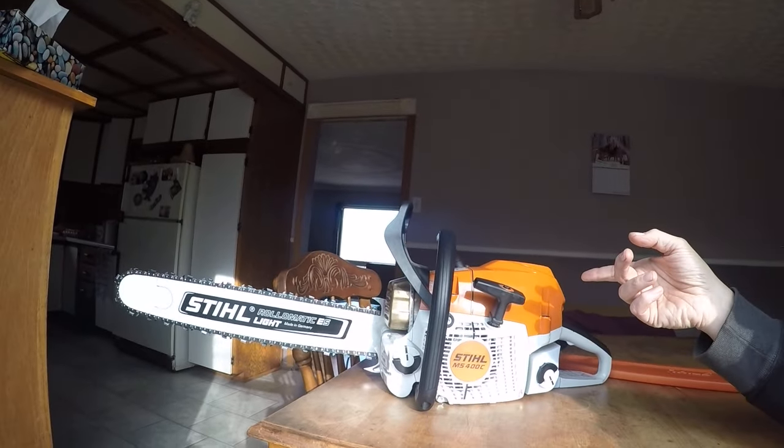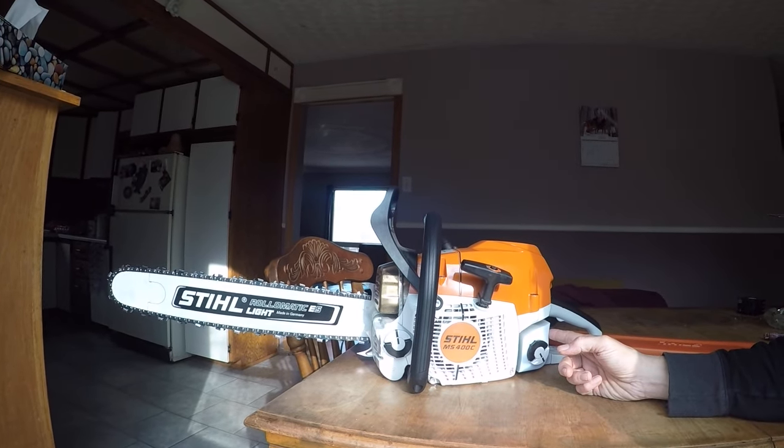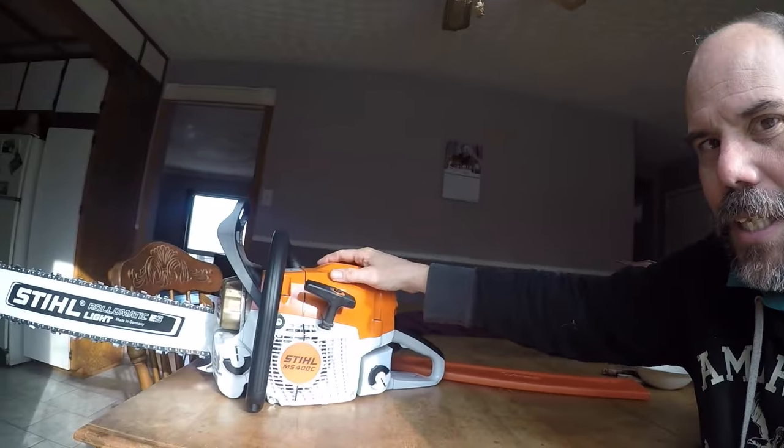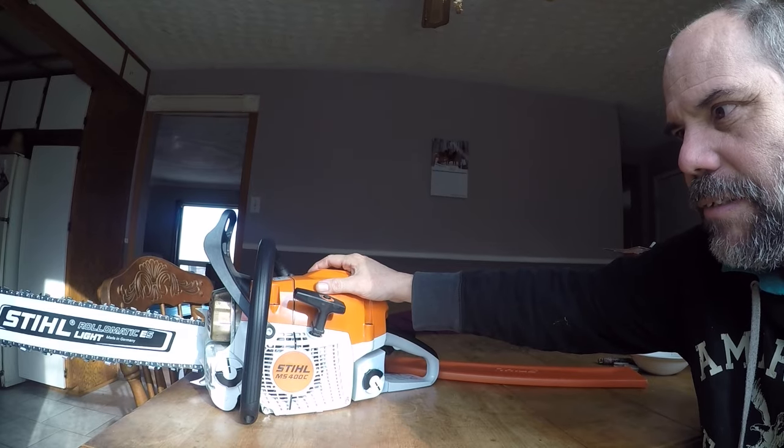The 500i — everything that's phenomenal about it is really well known. It's fast, it's light for its size, but it's not a light saw. If I'm going to carry a saw that heavy — 3 or 4 pounds heavier than this fully loaded for the same given bar — the 500i has more fuel capacity, so that's where you're getting the extra weight, not necessarily just in the head. There's only about a pound to a pound and a half difference between the heads, but it's in the fuel fully loaded.